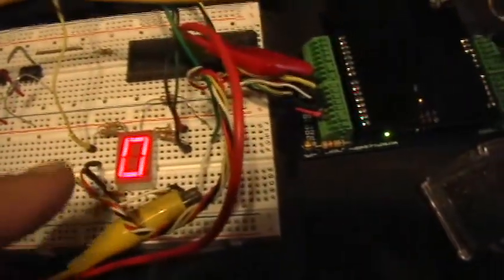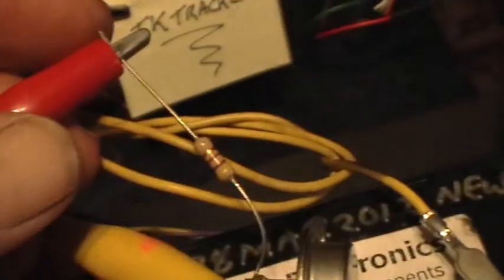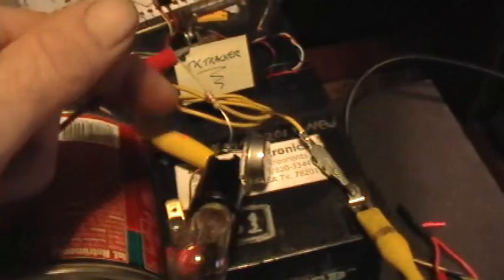I've assigned the MOS pin from the MOSFET sketch over to one of the PWM outputs, which is in this case pin 10, and then that drives the base of the 2N3055 through a little resistor — I think that's a 470-ohm resistor there.